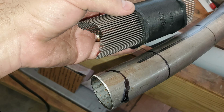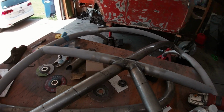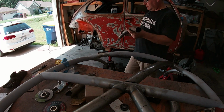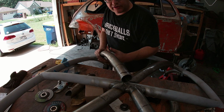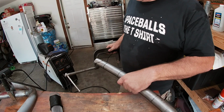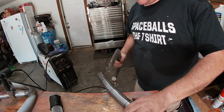Once you have the basic cope shape in the pins, I slip the tube in and using a Sharpie, trace that cope onto the tube. Real fast, make sure that this will fit the cutout I'm seeking for it to do. Okay, that looks like it'll fit. Measure twice, cut once. Or check twice, grind once, whatever you want to call it. Pick your pleasure.